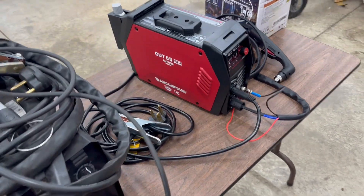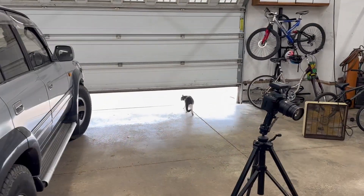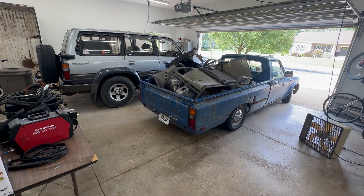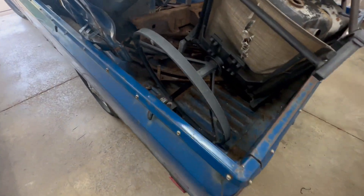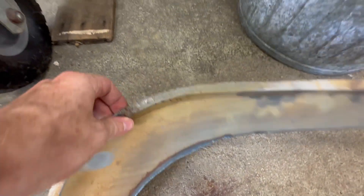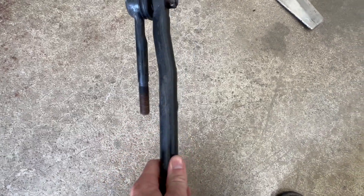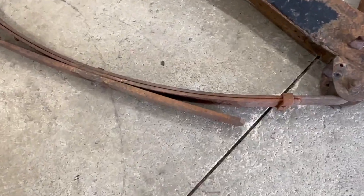Alright, let's try it out. Unfortunately I don't have any current projects that I could use a plasma cutter on, but let's check out the scrap pile. I'm sure we'll find some good stuff in here. There's a leaf spring way down there, plenty of rusty Toyota frame. I dug out a piece of frame — this crossmember is two or three millimeters thick. Here's a piece of sheet metal, just thin 20 gauge. Here we've got a relay rod and it's like an inch thick — we'll test the limits of the cutter on that. And leaf springs — that bottom helper leaf is about a half inch thick.